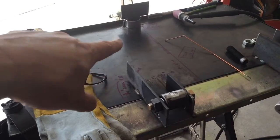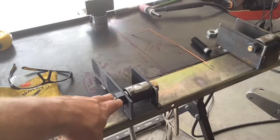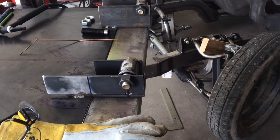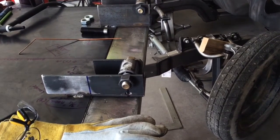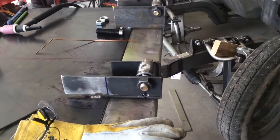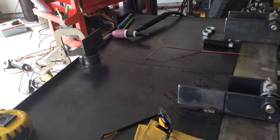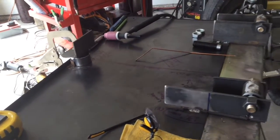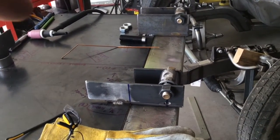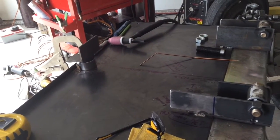And then I've got to move. See, way up here at the front, I've got a ball ring collar, and I'll take that apart and show you what I've got there. But I'll swap them. You can see real close here. They're actually at two different heights. One's actually built on a piece of 3-inch flat bar, and this closer one is built on a piece of 2-inch, and that's to build the suspension geometry into the A-arm. So now you can see that little collar a little better. Take that apart and show you. But so I can cut these welds loose, swap their places, and move the collar to the other side of the center line, and then it's set up for a left lower.